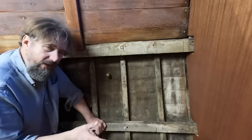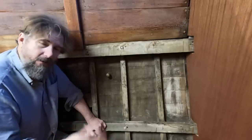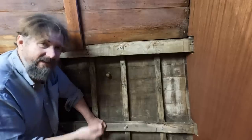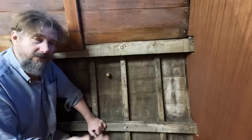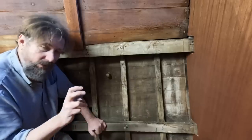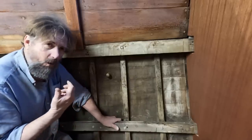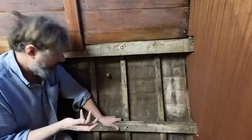That is a vacuum ventilation rather than putting air in. It's sucking air out so that if there's engine smells, etc., or excess heat, it's withdrawn. In the case of a gasoline engine, of course, it would be the blower that runs for 5 minutes before you start the engine to make sure there's no fuel.